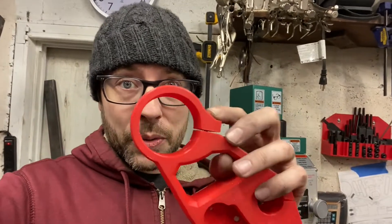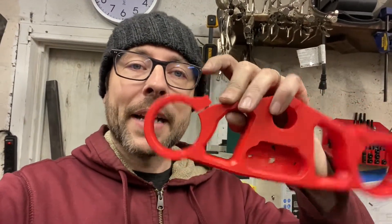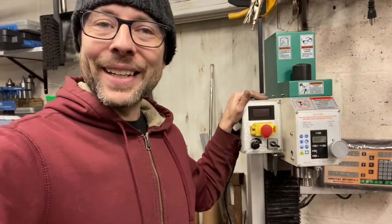In this episode we're going to do the slot and the bolt holes that are at a 45 degree angle on this triple clamp, and that'll turn this triple clamp into actually a clamp that can grab the fork tubes in the steering stem. There's going to be some really interesting mill setups on this video. I have to rotate this milling head 45 degrees to machine this — I've never done that before. I think it's gonna be really interesting, so let's get started.